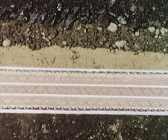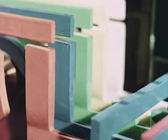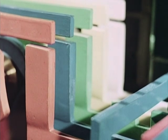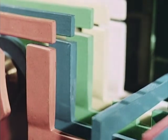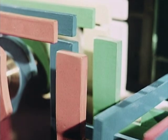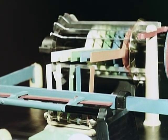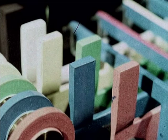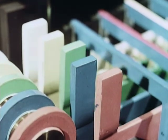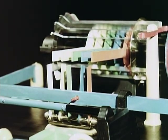The telegram message is sent over this cable by means of the code, which starts in the transmitter as a combination of five bars. We've colored the bars so as to identify them. This is the code for letter R, for example. For S, the green and orange bars move forward. Through the cable goes the code for S. As it reaches the receiver, the code is reset up in these arms — the green and orange arms are raised. Now the code for R: yellow and blue move forward. The code for R is reset up in the receiver; the yellow and blue arms are lifted.